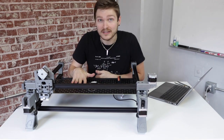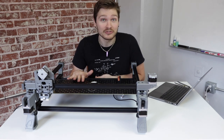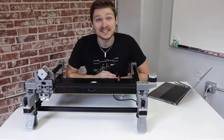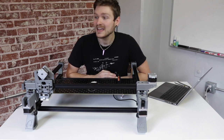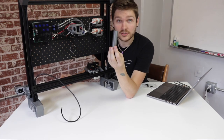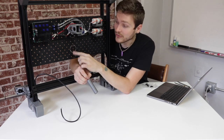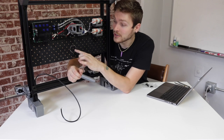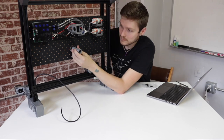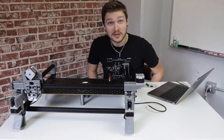Now we need to mount the feet to these two plates. Both plates are made of FR4 — the same material as circuit boards — so we need to add support in the middle for rigidity during placement operations. Find the staging plate and build plate feet in your first-tray packaging. Lift the machine onto its back legs. For the build plate foot, unscrew the pre-mounted screw, place it through the center circle cutout of the build plate (the screw should poke through right under the goblin face), and use an allen key to hold it while tightening from below. Then drop the machine back down.